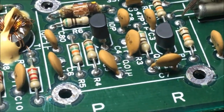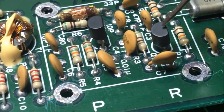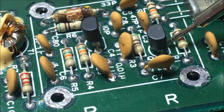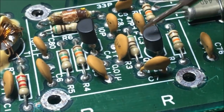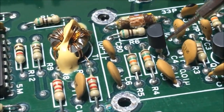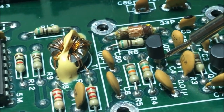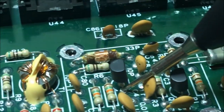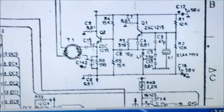So what I'm seeing here is there's the clock signal off the crystal, and then it goes into the base, which is emitter collector base. It's right there. The collector is tied high, and then off of the emitter it comes out, and then it makes its way over to the base of Q2, which is right here, and the collector is tied high again, and then it goes through, and right there it's just tied low, stuck low at the emitter of Q2. So Q2 emitter, it's tied low.